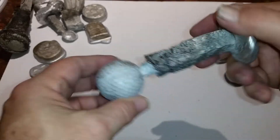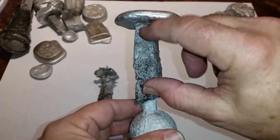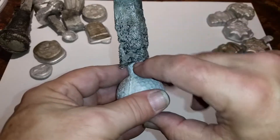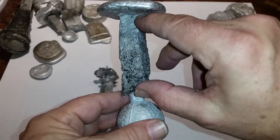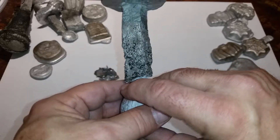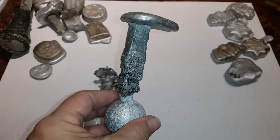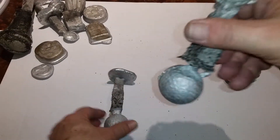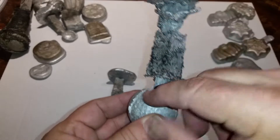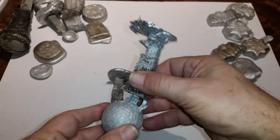I'll cut all this off now and just keep the golf balls. I wanted to record this because that's the result of the volume of this cavity. I think this sprue should have at least the volume of this cavity if you're going to use a foam fill gate and an open cavity for where you're molding, because this volume is going to fall in very quickly. You don't want this end result — this cavity on the top — if there isn't enough volume in the sprue to fill this entire cavity at once. Lessons learned. Thanks for watching.